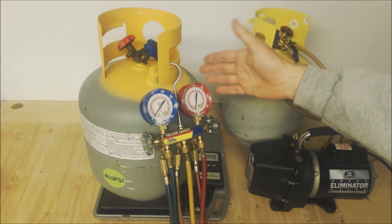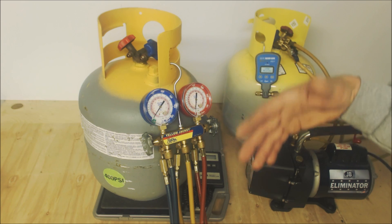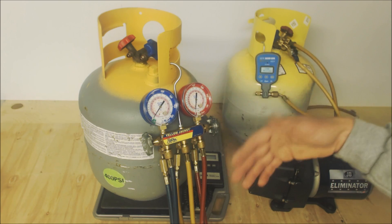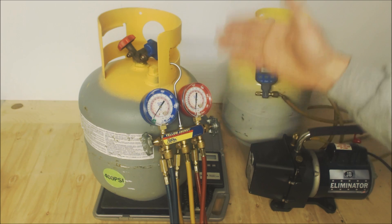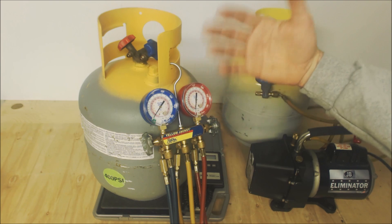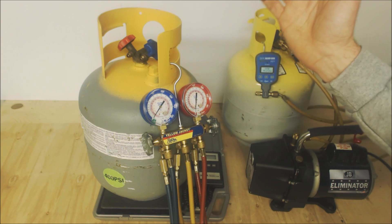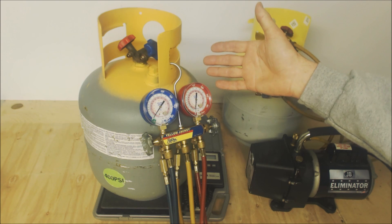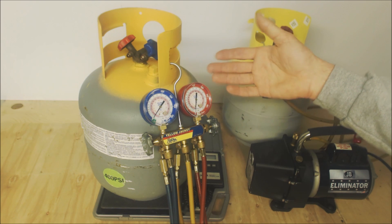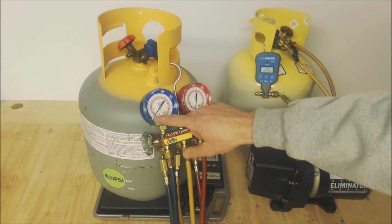If pressure doesn't match saturated temperature, they're not going to want to pay you for all the R22 in that bottle. Right now R22 is going for about five dollars a pound — could be higher in some areas, lower in others. Some supply houses want to charge you for, say, 34 or 38 pounds of R22, charge you a cleaning fee on the recovery bottle, and not pay you for the refrigerant — which is ridiculous. If you have a bottle with 34 pounds of R22 you're going to make about 170 dollars off that. That's part of your income — you shouldn't be paying for that.